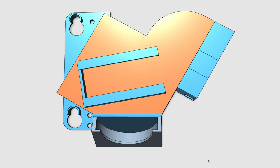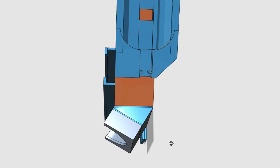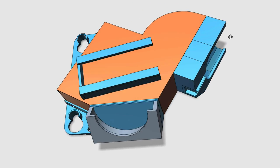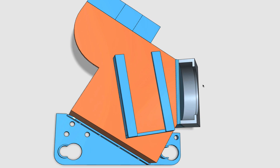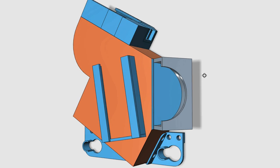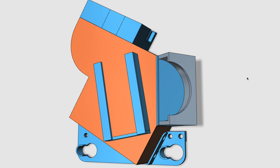We are back. Finally I put together the fan controller holder, which is these two units. Originally I built this gray box — the actual fan control holder — and I fitted the proper curve so the fan could fit in the curve right. This took a couple tries. I had to move it by about a half a millimeter out, then another half a millimeter out. When I finally printed it a half a millimeter too big it wobbled. It took probably five printing iterations before I got the exact size — not just from the calipers where I measured it, but from actually dropping it in.